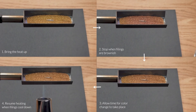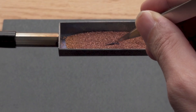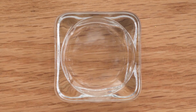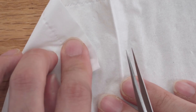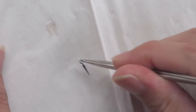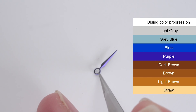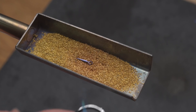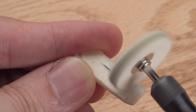So when it reaches purple, the blue can be only seconds away, so it'll help to pull the flame a bit further from the tray to slow down the transition. Once you see the colour you want, pick up the hand and drop it into the water immediately — this will quench the hand and lock in the colour. Pick it out of the water and dry it immediately on a piece of paper towel. If you wait for it to dry, water spots may develop. Dab and don't wipe, as the paper fibre could create fine scratches. If the colour is a bit on the underside, you can put it back and heat a tiny bit more. Be careful, because you cannot reverse the bluing process once you've gone past the blue you want. The only way to fix an overheated hand is to sand away the oxide layer, re-polish and re-blue. That's why it's a good idea to have multiple sets of hands with you.